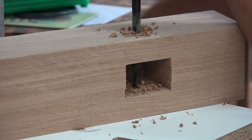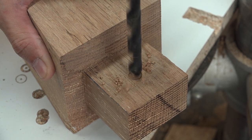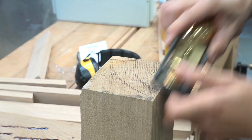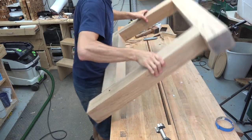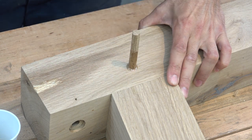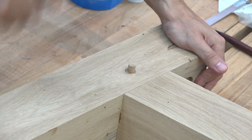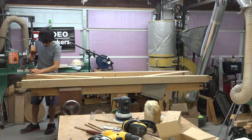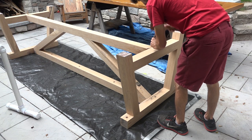To prepare the base for glue-up, all of the mortise and tenon joints are drawbored, so I drill all the offset holes through every mortise and tenon. I also drill the holes that will hold the top down to the base. The bottoms of the legs receive a chamfer and a coating of epoxy. For the glue-up, I used epoxy filler to give maximum working time — the assembly was easy since all I had to do was drive a dowel through each joint, which pulls it really tight without needing any clamps. With the side assemblies joined, I joined the connecting assembly, and then did the final outdoor assembly by connecting everything together.